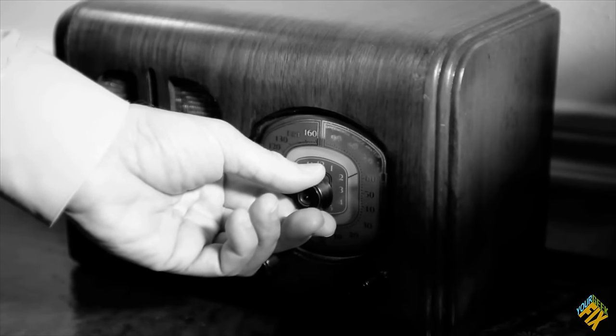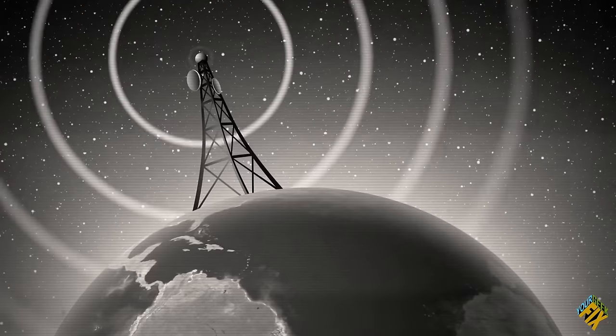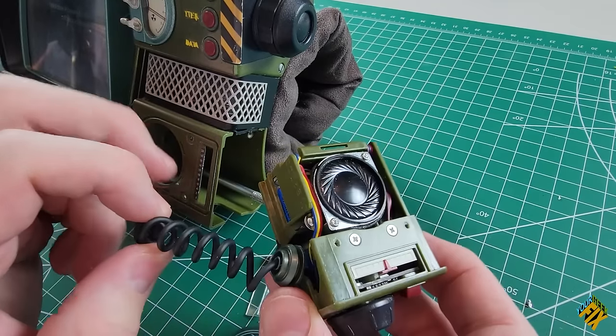The radio was a significant challenge. Those boxes at the end are a really weird shape — hard to mold, and only exactly big enough to fit two or three triple-A batteries. When you take the radio out, you'll see that one of the contacts at one end for the batteries is the actual PCB; there's no space to put contacts in there. Radio reception is also tricky — you need an antenna, and the wavelengths are in meters, so normally you need a big aerial. In the UK, especially in Chris's office, there was no FM signal at all, but when he took it to America it just picked up loads of stations straight away.